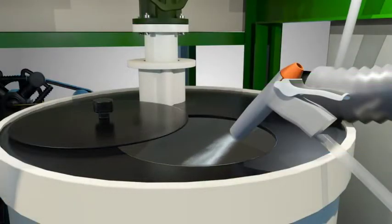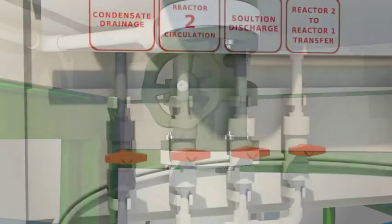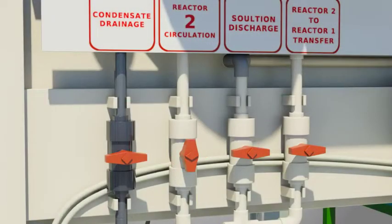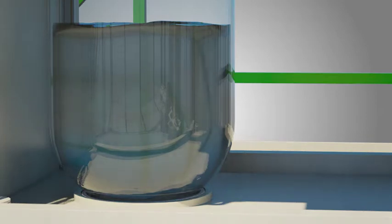The gold filter is cleaned up and washed before the start of operation. It is then ensured that the discharge nozzle of the precipitation reactor is adjusted to fit in the gold filter and locked. Now the pneumatic filter pump discharge valve is ensured to be in open recirculation mode from the front panel of the equipment. Once this is ensured, the precipitation discharge valve is slowly opened and simultaneously airflow is started to activate the pneumatic pump. This cycle of reactor liquid discharge, filtration, and recirculation ensures the formation of a bed of precipitated gold.